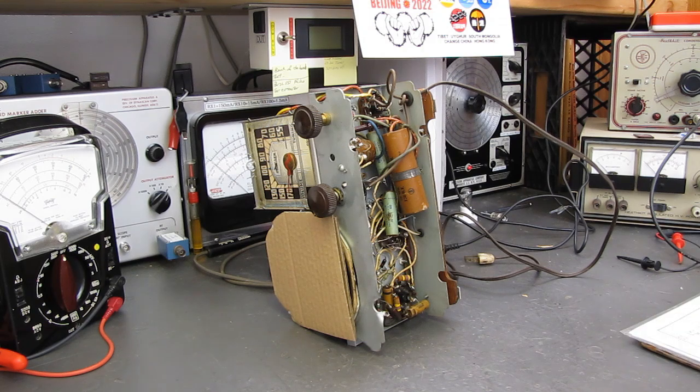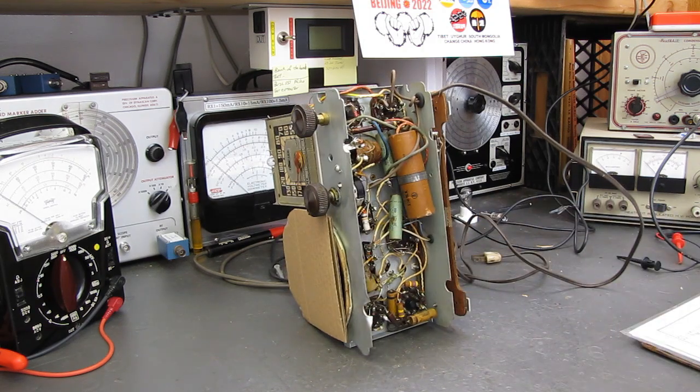And for a newbie doing this, and I've said this 1,000 times and I'm going to say it again, I'm going to show you what has to be changed initially to test the radio, and once you know the radio works or doesn't work, you've got a good baseline to continue. But if the new guy goes in there and shotguns everything and the radio doesn't work, he's left wondering, did it not work before or did I break it? So I am going to continue showing you how to bring it up methodically in steps so that you have a better chance at success. And I don't care if you want to shotgun your caps, you do what you want to do.